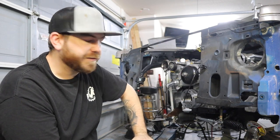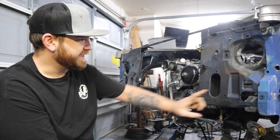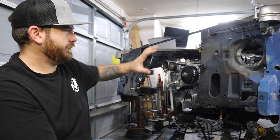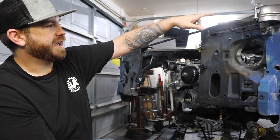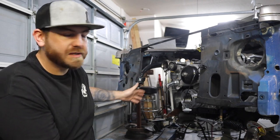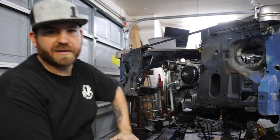And if I'm creative enough, I might make it so that the bumper is attached to the fender somehow, so that the whole front clip, I undo the bolt at the cowl, bolt down in the bottom in the wheel well on each side, so four bolts, and the whole clip just comes off. You know, unplug the headlights, four bolts, whole front clip comes off.